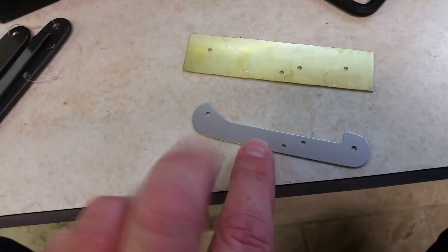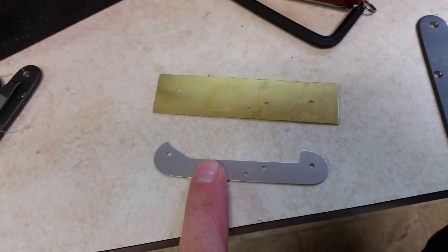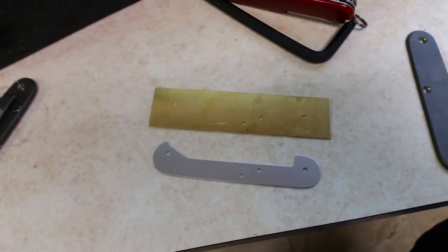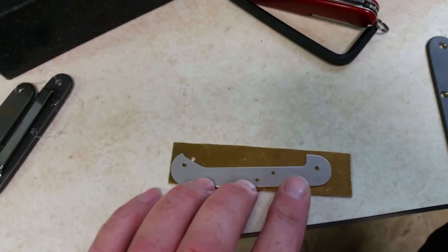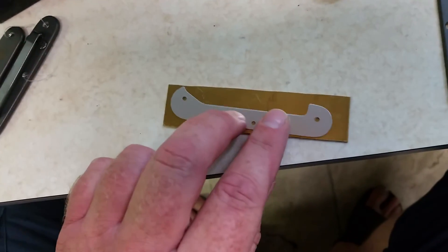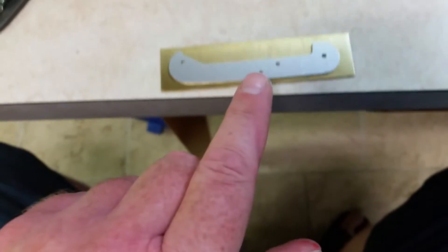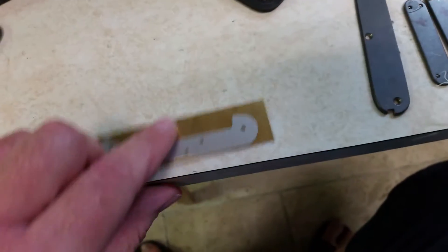This is actually the liner I'm making — these are aluminum liners on normal Swiss army knives, and a lot of people like brass. The most common combo I do is titanium scales and brass liners. This first op was just drilling. I know I'm taking baby steps getting to a final automated solution, but watching it drill all these holes without me having to do anything felt like cheating almost. You can see those four holes it drilled — they do line up exactly. The inner holes are 2.2 millimeter and they actually need to be 2.5, but having them located will be fine.